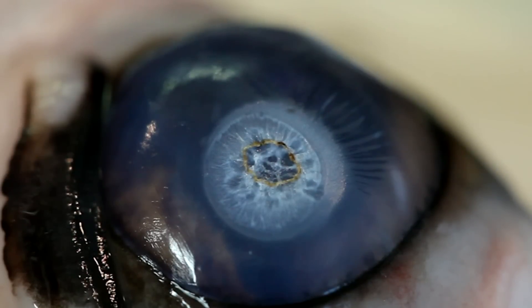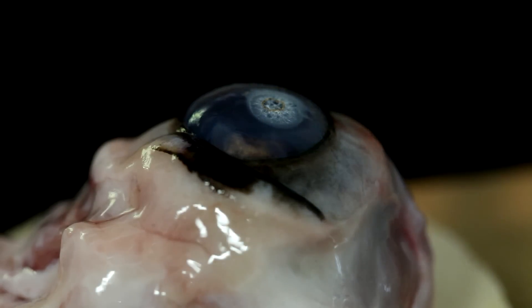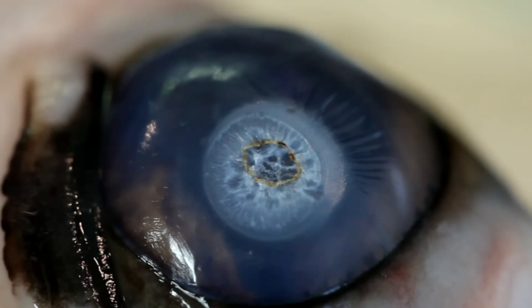I have a newfound respect for safety glasses. That is absolutely terrifying. That was a really quick pull, just smacking the laser and it exploded the cornea — those little pits and craters. Maybe we should find an eye doctor and ask what kind of damage this would do to you. That's an 80 watt laser. I think the cornea damage from that first hit — this is something you're going to feel the effects of your entire life, or it can be lessened. This shot right here — the cornea took the full brunt of the CO2 laser and on body parts the CO2 laser causes vaporization of tissue.